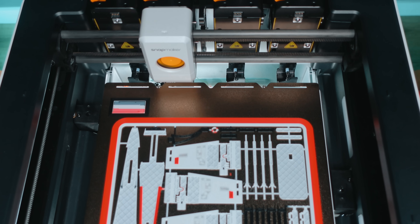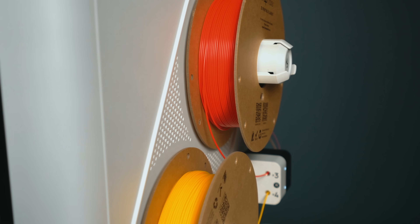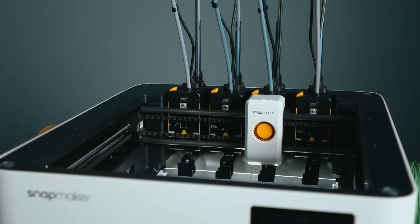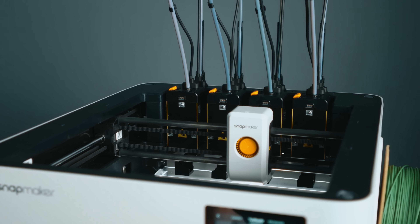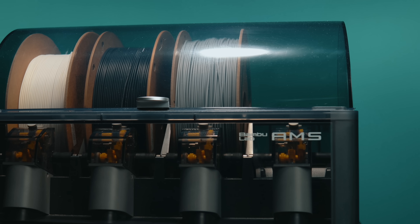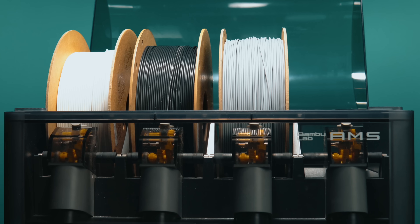The U1 is lean — it uses almost every gram of filament it loads, but there are trade-offs. The U1's filament sits completely exposed with no enclosure or dryer, meaning humidity can affect your prints over time. It also doesn't come with a lid by default, so printing materials like ABS or ASA can lose heat through the top, and you'll need to manage airflow and drafts in your printing area. Meanwhile, the AMS on the H2S keeps filaments enclosed, heated, and dry, ready to print at any time — a major advantage for reliability, especially in varying environments. That's not to say you can't use a filament dryer with the U1, but that will be external and an additional cost.